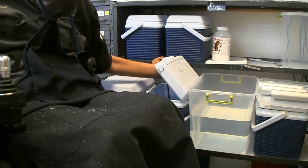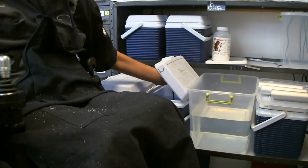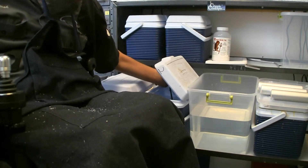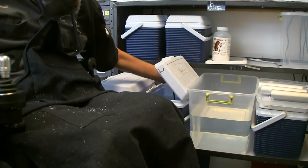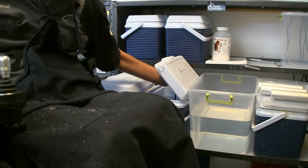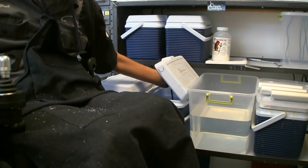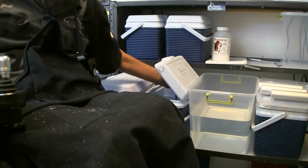It takes about five minutes to get the anodizing off. While that's happening, I'll explain why in this case we're taking the anodizing off. Anodizing is an oxidation of the outside of the aluminum that makes it harder and more durable, so it seems strange to want to remove it. In this case, we're using this tube in a welded assembly. In order to weld the aluminum, you can do what they call burn welding through the anodizing, but the anodizing being harder is a lot harder to burn through. The temperatures get a lot higher on your TIG torch to burn through it, and you risk burning too much through the raw aluminum underneath. By taking off the anodizing, it will be a lot easier to weld to the other material we're using that's not anodized, so everything will be in the same condition and you'll get a consistent good weld all the way around.